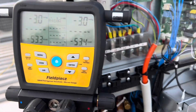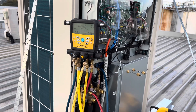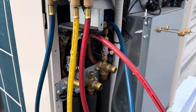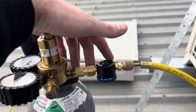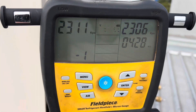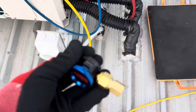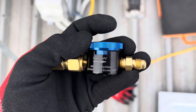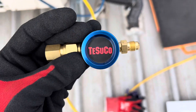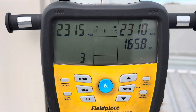There's not much — that's totally worth it. That's us done for at least the next little while. They'll get the new head installed and we'll move on from there. We're just going to purge some nitrogen for the mechanical guys. I've got this little purge regulator — very cool, about 70 bucks, picked it up from Actrol. Brilliant. We are now up to a pressure test. We'll let this sit for half an hour and see what happens.